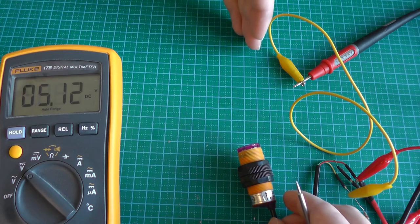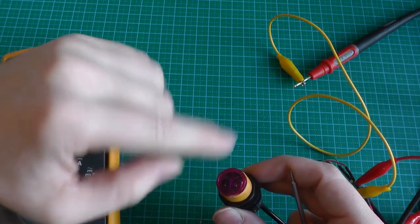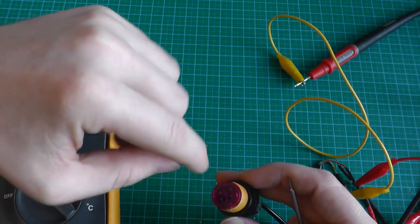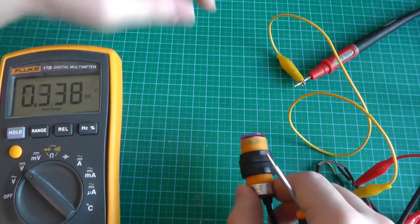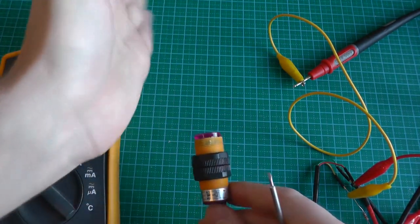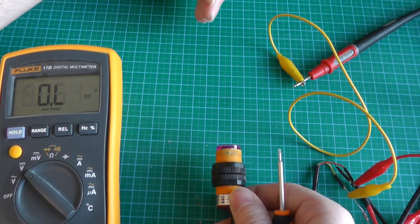What's pretty nice is that it's very narrow — really focused in front of it. If I run in front of it I trigger it; but when I go a bit left or right, I don't trigger it anymore. Because of this lens in the front, the light barrier which is created is a very narrow beam. And the lens on the receiver also makes it very focused on exactly the thing in front. So you can be sure it's in line of sight — it really has to be in front to operate. It creates a straight-line light barrier.